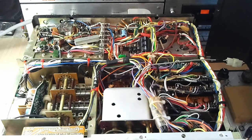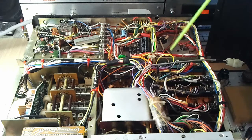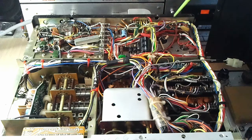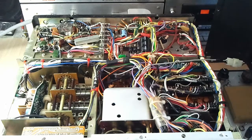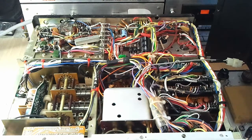Over on the right hand side, these two capacitors here are on the high tension supply in series, and they've got 470k equalising resistors across them. I thought I'd better check all the power supply volts. I did, and I even checked the capacitors, and they're fine, but I did find the carbon composition resistors that were here were high. So I've put new 470k ohm resistors there, and I've replaced the 470k on the screen supply as well. I've also replaced a 6.8k resistor that feeds that ALC transistor.